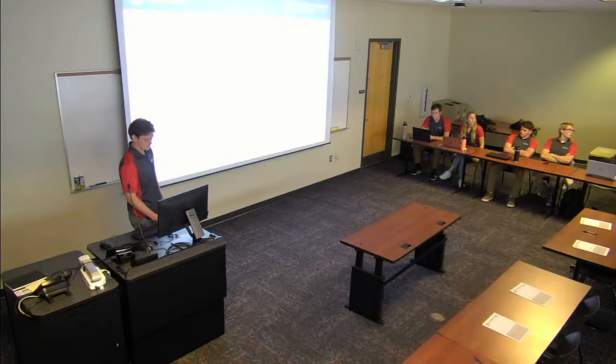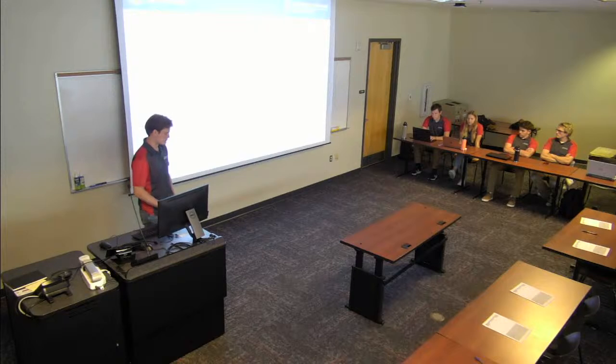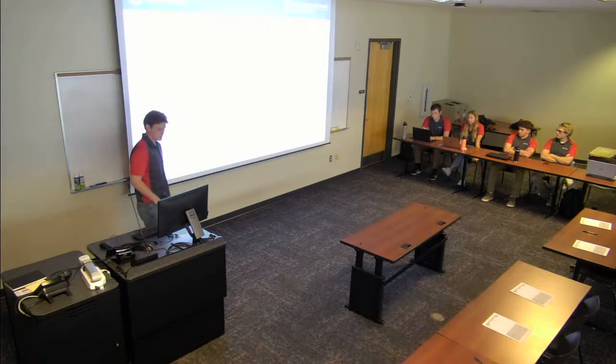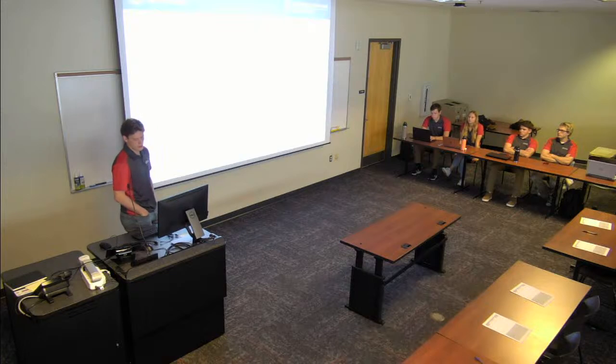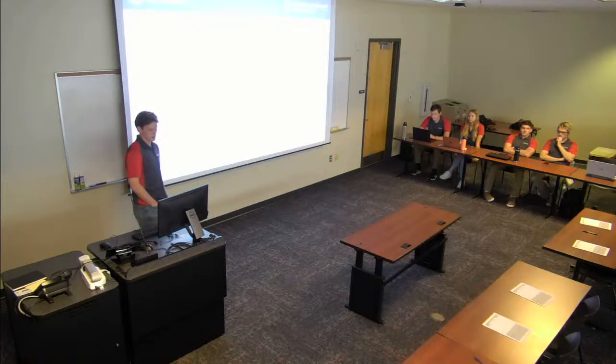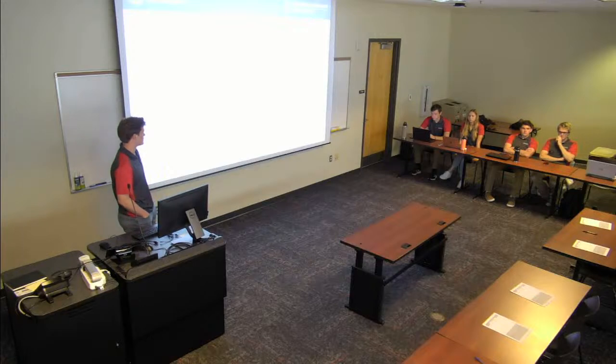All right, and if there are no more questions from the audience here, the question from the chat says, have you investigated the instrumentation issues faced in the test stand last year? Are you trying new sensors, new DAQ? We have not. We haven't really talked about a new data acquisition system. We are going to order a new load cell, and the pressure transducer seemed to work fine for the most part last year.